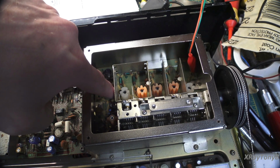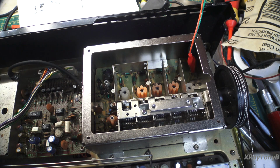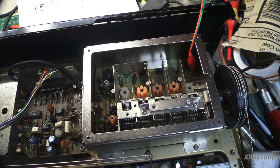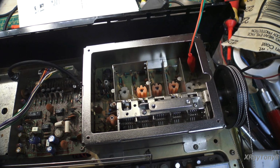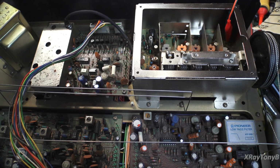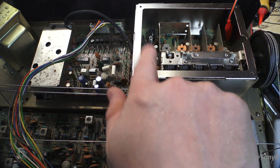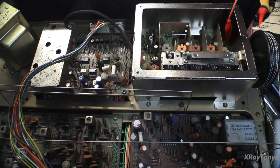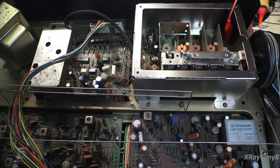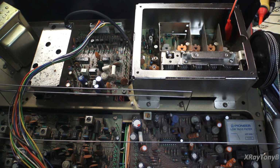See that? And if any of you are regular followers of my channel, you'll see I did that trick on another radio that I was repairing, and it ended up being that transistor was bad. This MOSFET, first of all, if you connect test equipment to it, it swamps things out a lot, so you got to be careful how you hook up your test equipment.